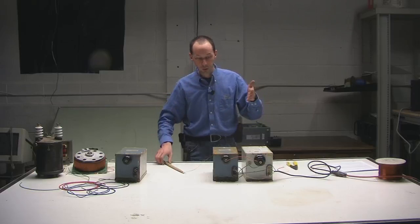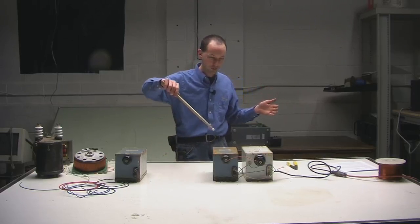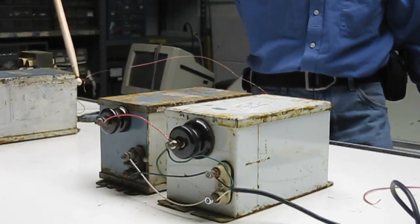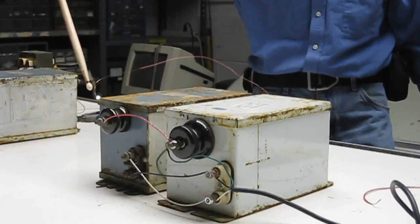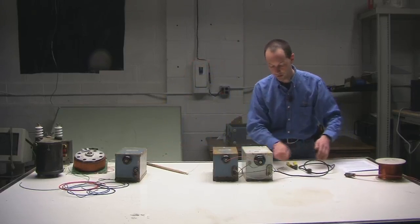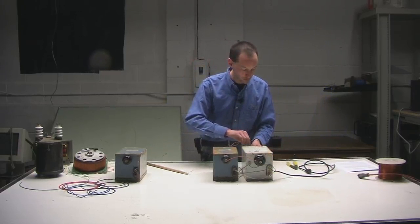So we've got 12,000 volts. So if I bring this in, we'll do it up front so you can see it. Now, I'll come in from the side. Now, that's the little wheedly 60 milliamp arc. And I can pull it out about an inch, and it dies. Okay? So now I'm going to disconnect this. Safety. Cool. And I'm going to connect both of these transformers together.